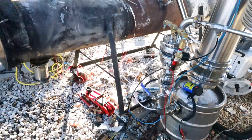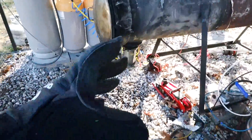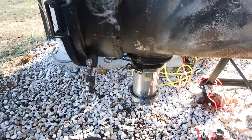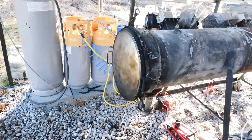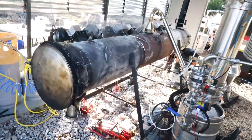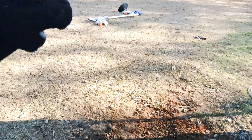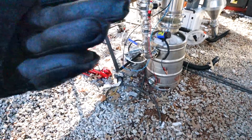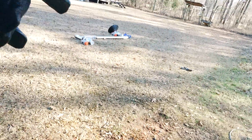One thing I haven't fully designed yet is the continuous discharge system for the carbon byproduct. We don't produce that much carbon, so I'm thinking I'll put a stubby keg-style tank underneath to capture it — it probably won't fill up until after maybe ten continuous all-day runs with a few hundred pounds of plastic total. For continuous operation the discharge side would also need an airlock, but since carbon output is low, we'll see how that goes.